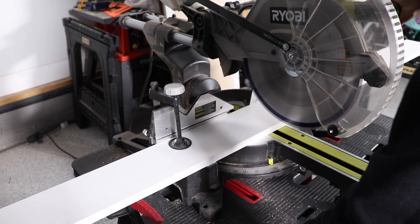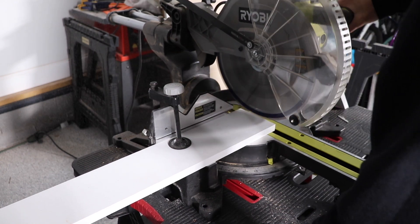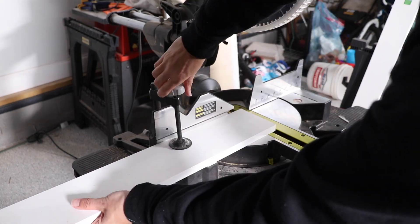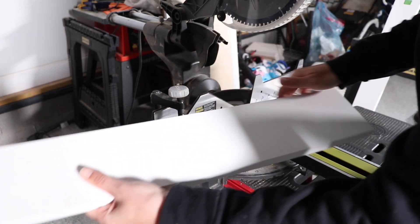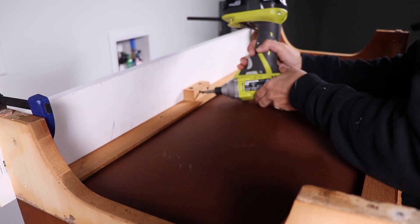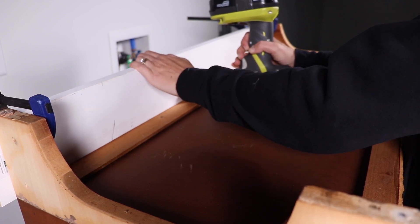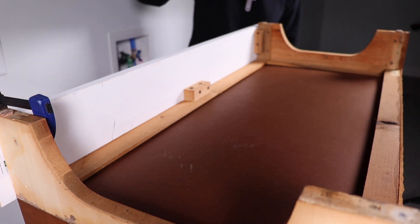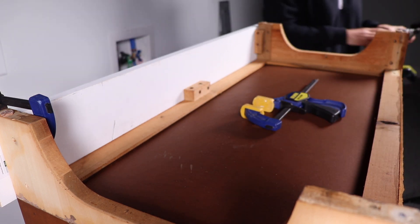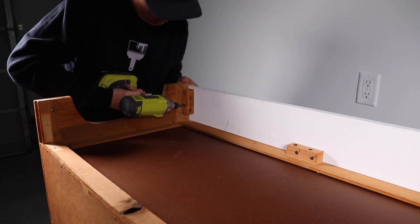I'd like to mention this is the first time I used the miter saw by myself, unassisted. I'm learning new things — learning not to be scared of power tools. It's a lot easier than you think. Once I got all the boards cut, I lined them up, started with the one in the middle, got it exactly where I wanted it, and attached it using the existing screws and holes. I used clamps to hold it in place until I got the center screws in.